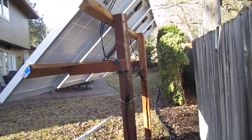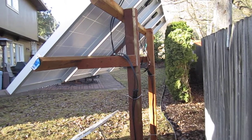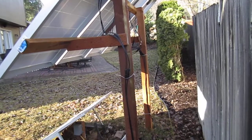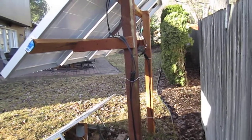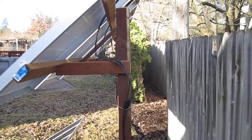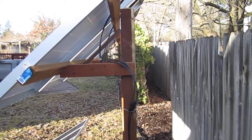This is pressure treated wood with screws, and that's it. I used 4x4 posts — they're 8 feet long. I've buried them in the ground about 24 inches or so. They're roughly in line with each other, off by maybe an inch or so, but it doesn't matter. Wood is pretty flexible.